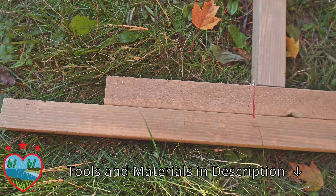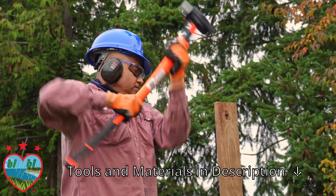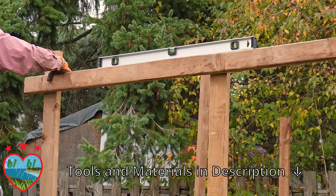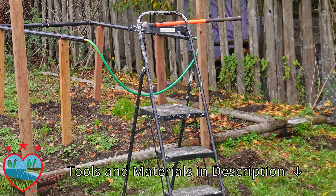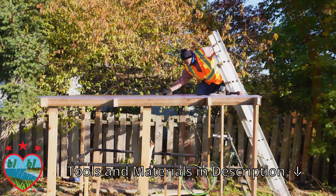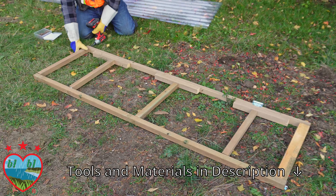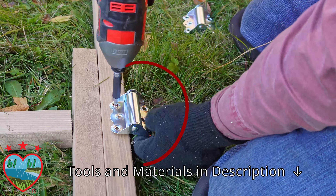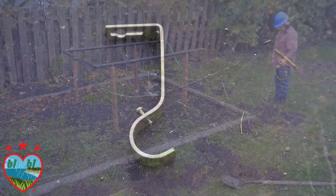Other bits: square head, T18, T20, and star head Phillips. Two tape measures, two color markers, tin snips, wire cutters, sledgehammer, shuffle hose with water, 2-foot leveler, and two foldable 8-foot ladders. Materials: 8-foot by 2x4 pressure-treated wood, about 20 pieces; 8-foot by 2x2 pressure-treated wood, about 4 pieces; 26-inch by 8-foot corrugated clear PVC panels, 20 pieces; self-spring fence door hinges, 3 pieces. For the door handle, we got a little creative and used window curtain brackets.